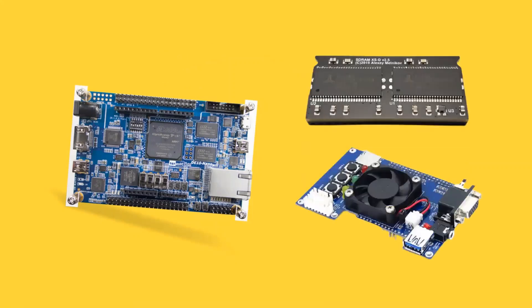This SDRAM port is required for most cores to emulate a retro memory module. Then it adds an I/O port. This port plugs into the GPIO1 connector of the DE10 nano and provides a legacy VGA output, 6 bits per component, analog audio, digital optical audio, buttons, and LEDs. This port is useful if you prefer VGA over HDMI or you want to put the MiSTer inside a case to get the full package. This port also helps for core development.